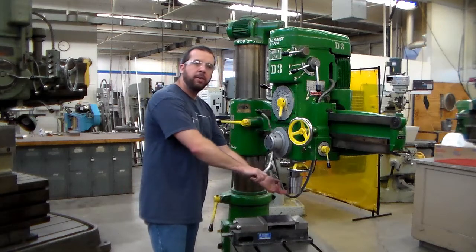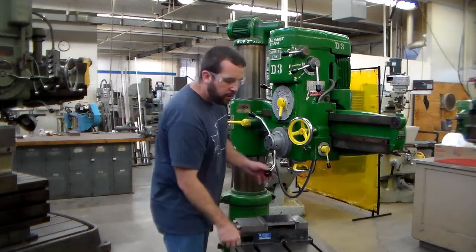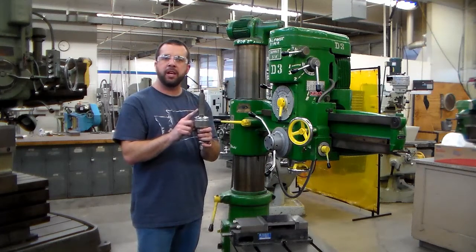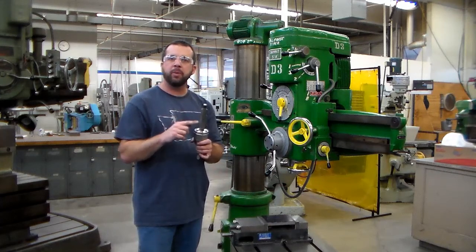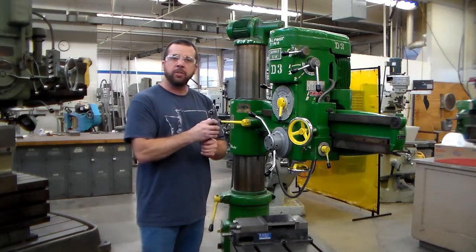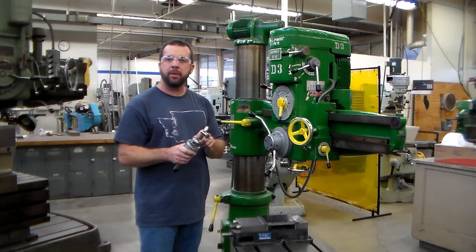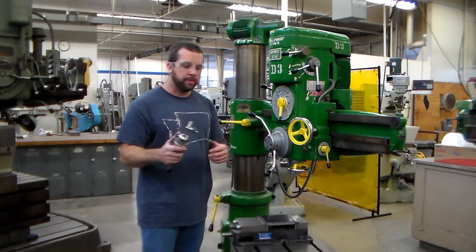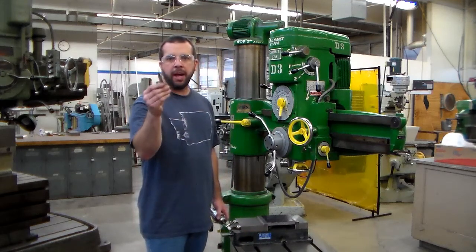So, this right here, what I just lowered down, is our spindle. Either we're going to be loading a taper shank, a Morse taper shank drill chuck into this spindle, or maybe we'll be putting a drill bit that has a Morse taper shank directly into the spindle. And you probably still remember from our first drill sharpening instruction, we only hold straight diameter shanks in drill chucks, never taper shank drills.